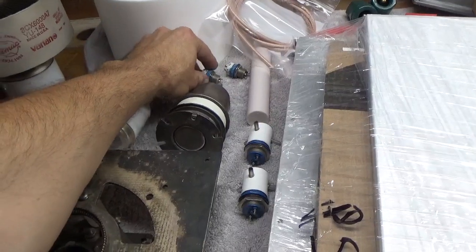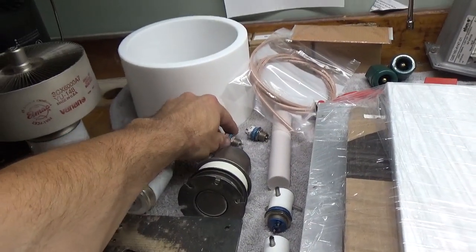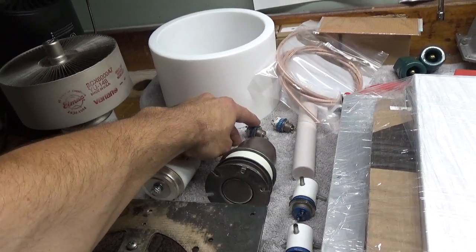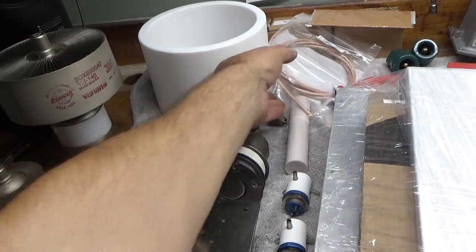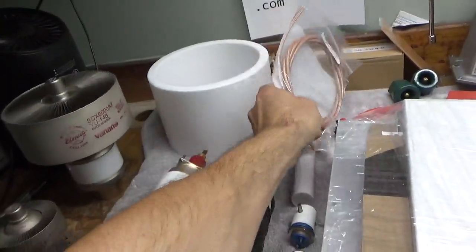The RJ-1As were pulled out of a brand new antenna switch box — there were a whole bunch in it, brand new, sealed up in military packaging from overseas. One is for the bias switching, and one for the input RF switching. And this is RG-400 for the feed-through coax going to the input circuit.